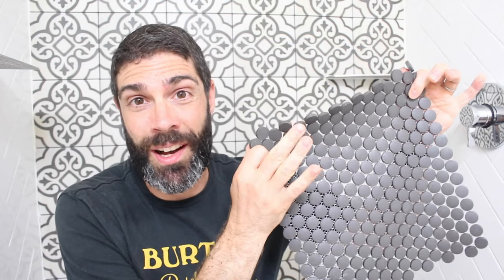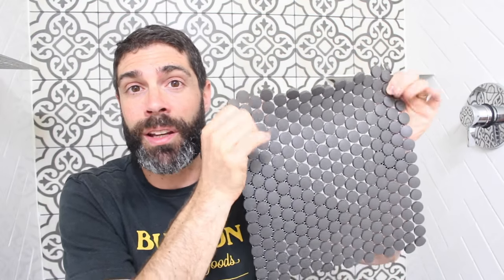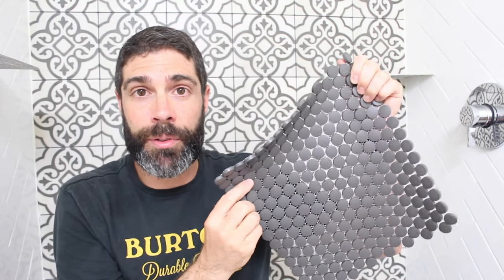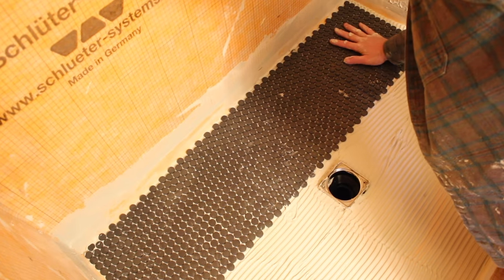One of the most critical concepts with a mosaic is making sure that when you set it, you can't see the intersection between the different sheets. They should all become one cohesive, monolithic-looking piece of tile in the shower pan. It's very important that you bond the tiles such that you can't see the lines between the sheets. That happens when you first do a dry layout: do the dry layout first, apply the thinset mortar, then bond all of the dry laid-out mosaic sheets while still leaving the 1/8 inch expansion and contraction joint at the walls and curb.